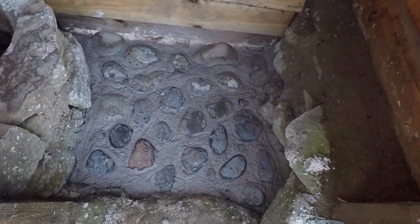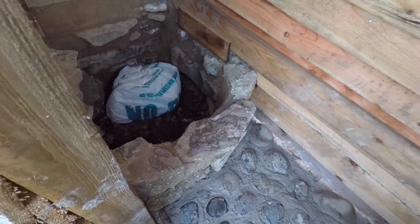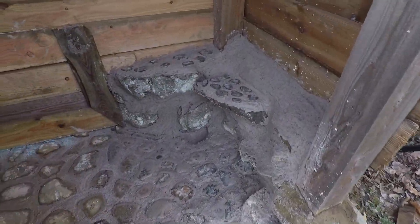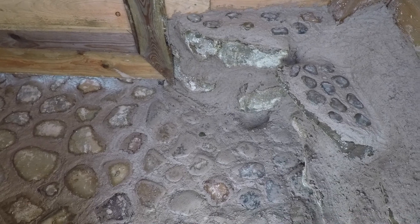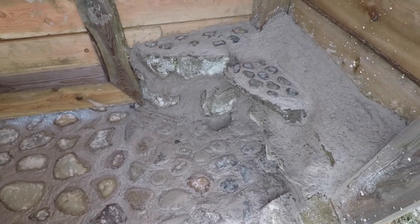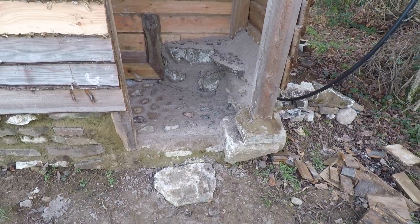The toilet side is pebbled. I've just got some lime in there, so I need to make something around that - probably wood - and put a toilet seat on it and figure out how it's going to be emptied and all that. That's the main sort of base for it. That floor is done. We've got some plastering done with some pebbles, which is nice. This has got about 10 to 12 hours now before the temperatures get really low, and then later on I'll come up here and put down some old blankets and cover it up once it's lost a bit of its moisture so it doesn't just sink into the blankets. It'll be left for probably a week or so at least while we've got these cold temperatures.